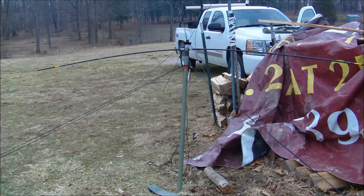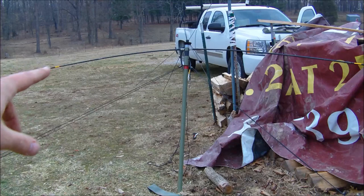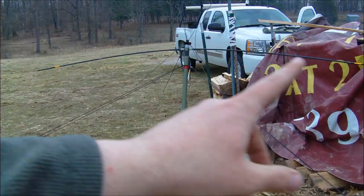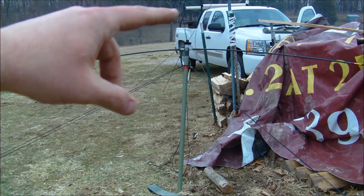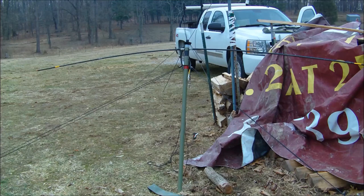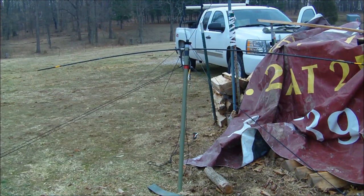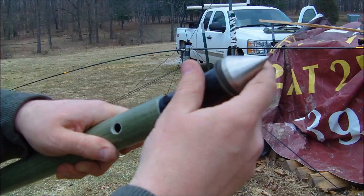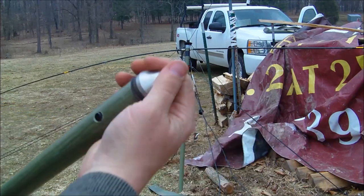There's the whole antenna from this tip. The telescopic elements here aren't stretched out yet, and over on the other side it goes a little off screen. So there's your dipole for HF, and up here are your transmitting elements for UHF and VHF, as well as the ground plane elements. At this point you want to attach your coax — you can see the coax leads coming right off there. I did forget one piece — this piece here — it fits into the bottom and gives you a point to jab into the ground, which helps if you're on a gravel driveway.